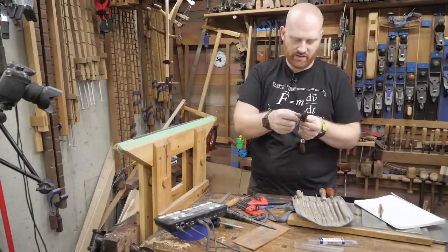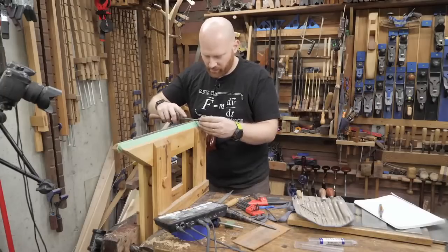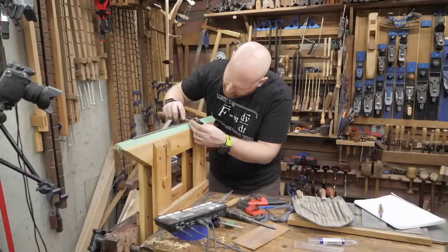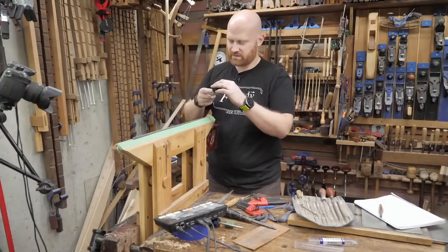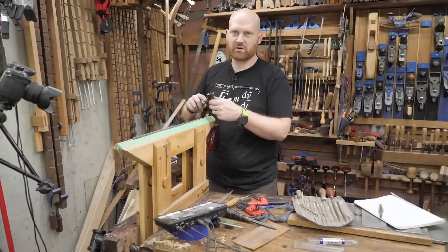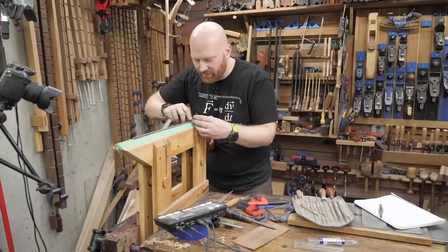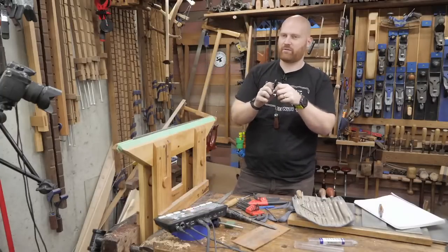So in this one, there's a good bit of fleam on here. So let's loosen up the fleam. Let's see. The rake, last time I had, rake is usually at like nothing. And so I'm going to set that right here. So my rake is like 3 degrees off. And then my fleam, I'm going to match it up to what I had in the past, which is right there. So we're at 25 degrees fleam, right about where I want it to be. Usually around 25, 30 is where I'm gonna have it for most crosscut saws.